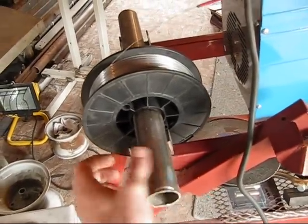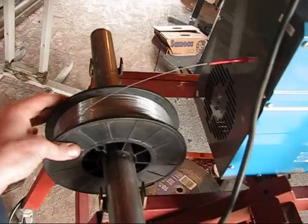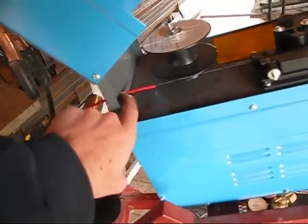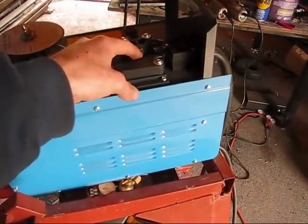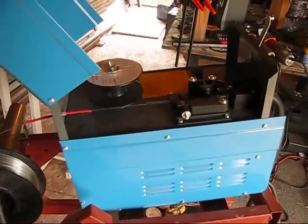Hello everybody. I want to show you what I did with the welder here. I took two pieces of angle iron and welded them together like that, then I just tack welded them right on to the back of the chassis here, and then just have the wire going up inside and it just comes in like that. I'm going to make sure there's an insulator in between here so that the arc doesn't happen. Since the electricity comes from the roller, you want to make sure you have an insulator there — because if not, it creates an arc right there and there goes my wire. It melts it right at that point.